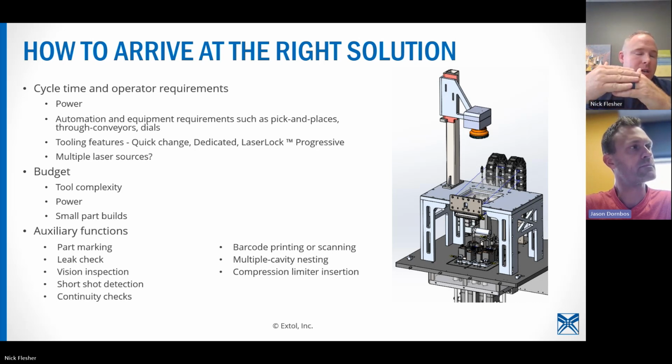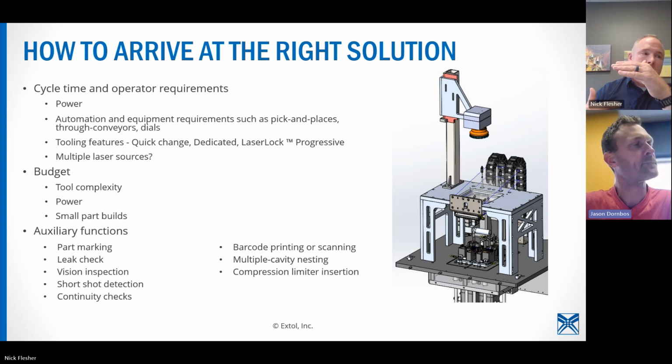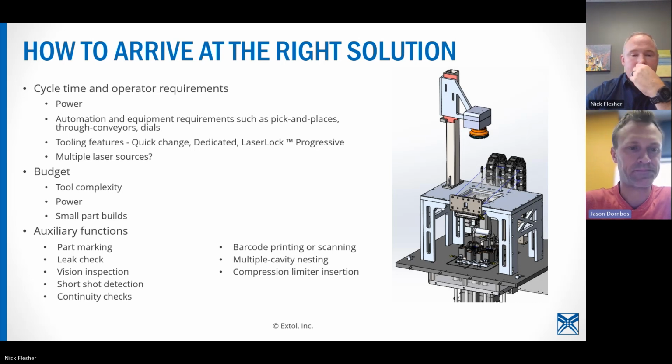The reason for that is you can accurately predict how long it should take you to get to that depth, and our systems have alarm limits on those. So if you get there too quickly, something changed in your mold process. If you get there too long, probably the same thing. So yeah, mainly it's by collapse.